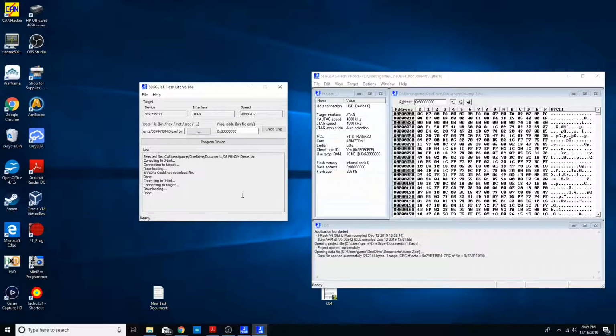So, looks like we had a successful write on there. So, that first time we had an error, I looked over at my power supply and I saw that it had dropped to where it was only pulling like 100 milliamps, so I knew that the processor had just quit working altogether. Gave it a little heat, was able to put the flash on there.